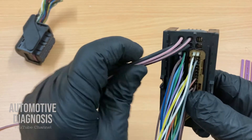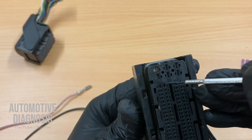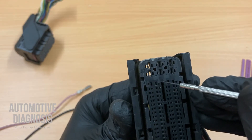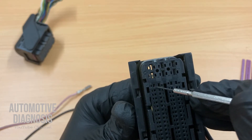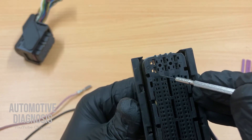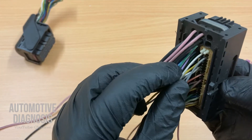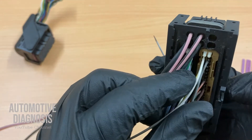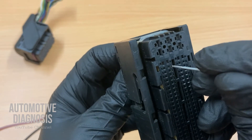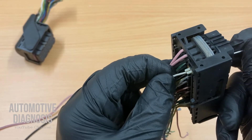What about the small wires? For the small wires, it's not really easy to reach them. We don't have a double tab — this is the pin and this is the little tab — so we have just one single tab for any of them. It doesn't have a double tab, so it's actually much easier to remove the pin. Grab the smallest tool you have. I go for this one — insert it there and release the tab. Super easy.